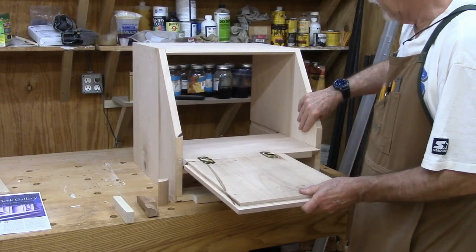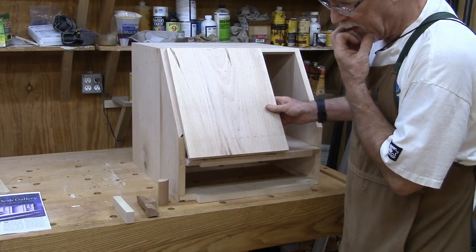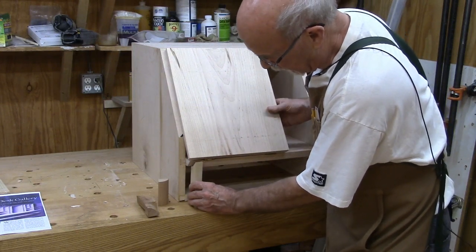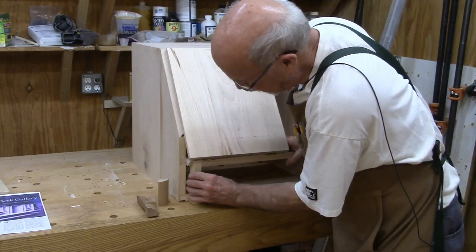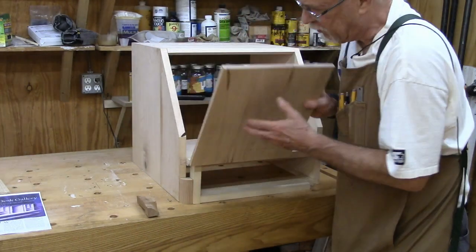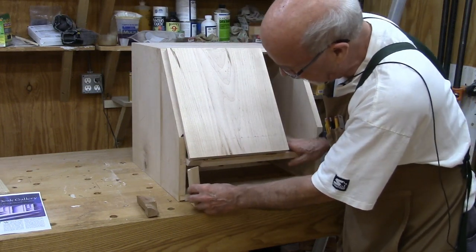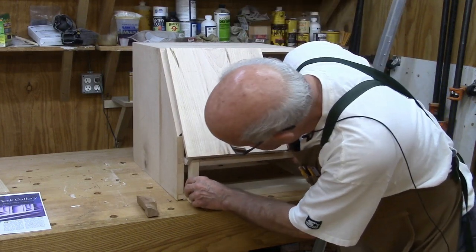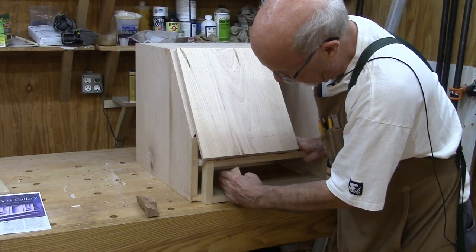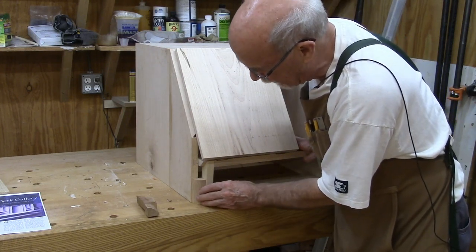Jeff Hedley has a technique he promotes in his Winchester desk design. You have to create a vertical surface, and an inch and a quarter by inch and a quarter piece for the quarter columns which go here. To make that joint work up here, there's a 45-degree cut under there which is part of the writing surface. You can see the angle — it slips in there and then gets screwed and glued on the side. Over here you'd have another vertical tenon so the lopers would slide in and out. This is the quarter column that runs in and out — it obviously doesn't have the flutes in it yet.